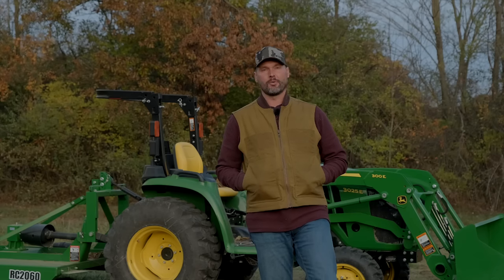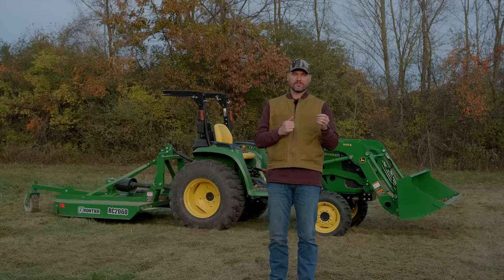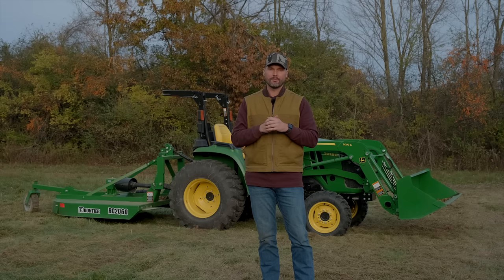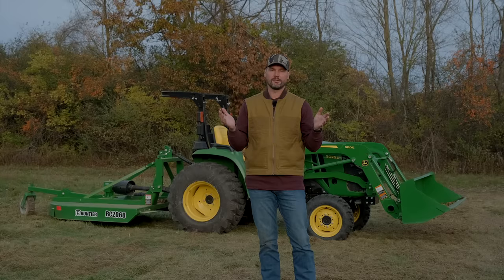But the main focus of this video was comparing the hammer blades and the Y blades. If you're gonna be in fields like what I have out here, I really think that hammer blades are the way to go. But if you think you might be using this on your lawn or just strictly in an area you're gonna mow repeatedly, that's just gonna be grasses, maybe some weeds mixed in there too, Y blades could be the way to go for you. Again, you don't want to dwell on that decision too much. The blades are interchangeable. Yes, that comes at a cost, but you can see they both get the job done, but it's more of selecting the choice up front that's going to be geared towards your primary purpose. So a field like what we have here, hammer blades, grasses strictly, or your lawn, Y blades, they're both going to get the job done. It's just food for thought.